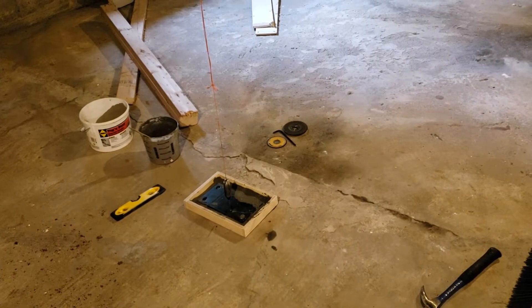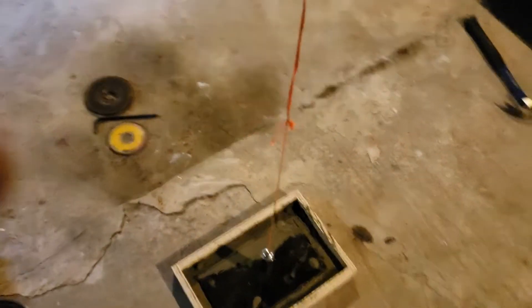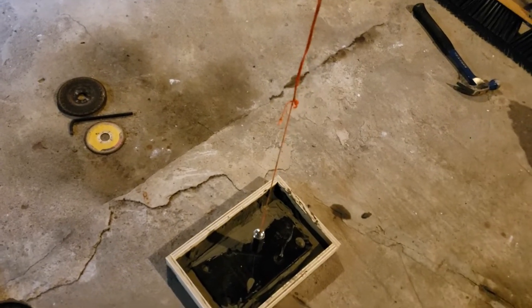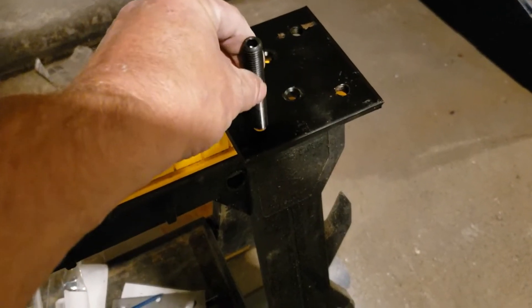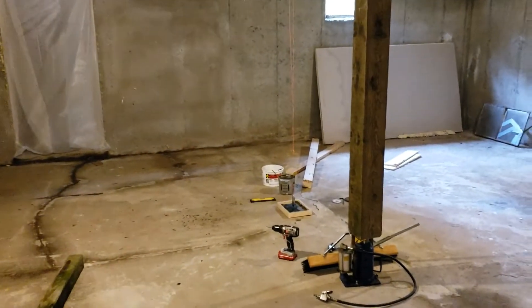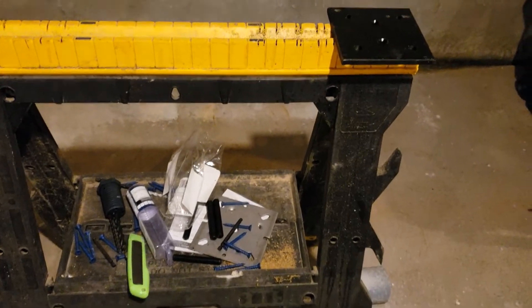It's filled the hole. It's kind of a little backwards from the way the company tells you to do it. They want you to put the adjustment plate on the lally column and then put that big plate — there are two holes there to thread the bolts through. These plates have a countersunk side, and these stud bolts go down through there, thread through there, and thread into that bottom plate. But because I'm concreting these in place, my bottom plate — I'll just set the screws in it when I put the columns in place.